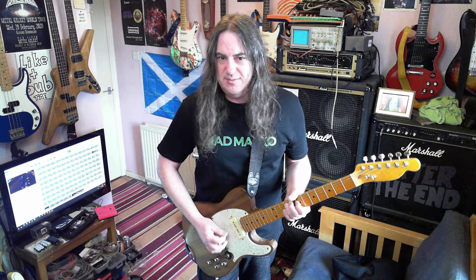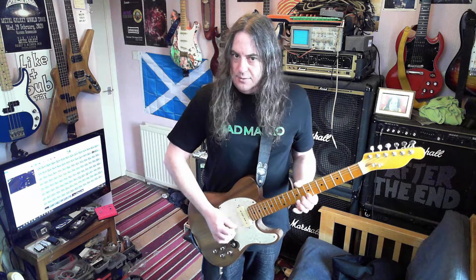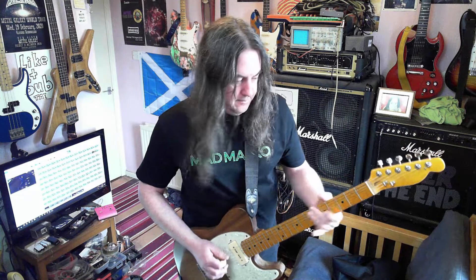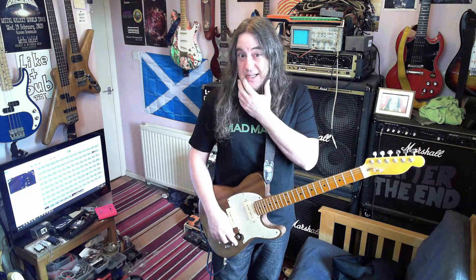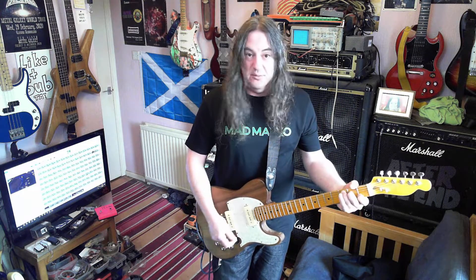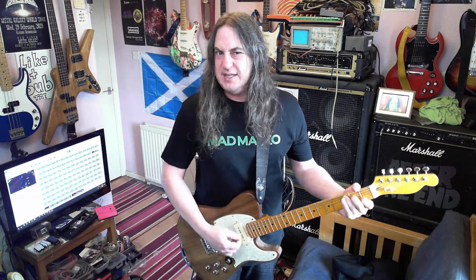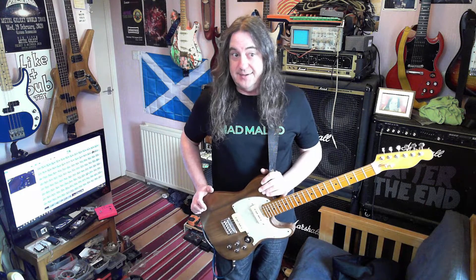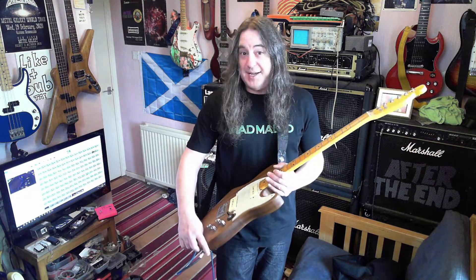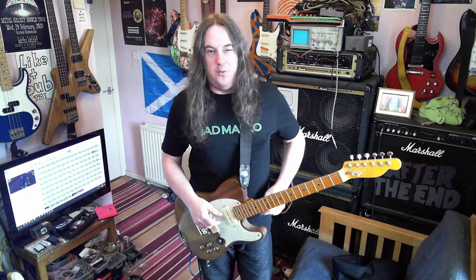It's got really bad strings — they're really low. It's also got treble bleeds fitted on it which were fitted on wrong, so when I got it the volume controls didn't work. They basically just went from fully on, and then when you turned it down it just stayed fully on until you got to nothing and then just turned off. I think the treble bleeds were in the wrong place. I didn't really look to see where they were — it was such a mess. When I was in the shop yesterday looking at it with the owner, I could see that a wire had come off the output jack, so that was why the guitar stopped working. But previous to that, the guitar didn't really work properly.